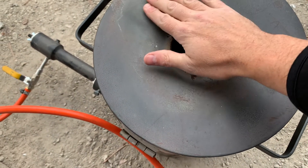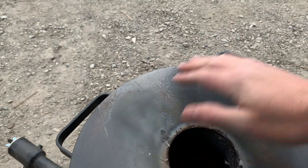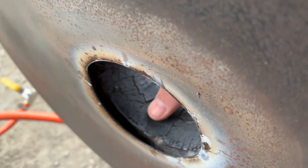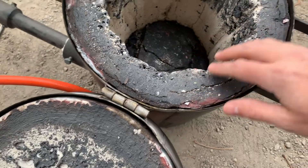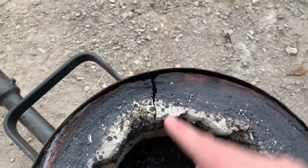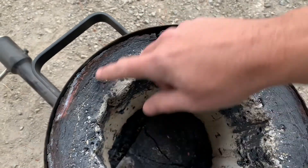You'll see it's starting to change shape just a little bit. We've got a little bit of a dent coming in right here, but I have a feeling that's because I put the spoon here to try to pull the metal off and it just dented where the spoon was touching. You can see right there that the wool is kind of pulling away. I'm worried about right here — you can see ever so slightly it's starting to dent, because as it's heating, a lot of the air and heat is venting to this side, and it's going to eventually burn a hole right here. To help preserve the metal casing, I'm going to want a patch right there.